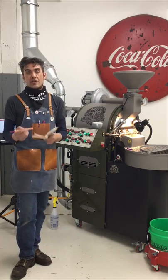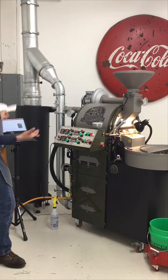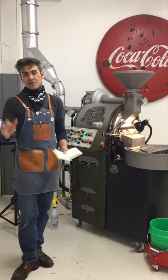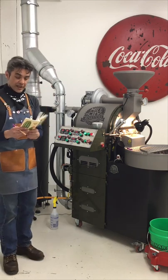The second question I'm going to ask is about ductwork — I'm going to ask about it and look at it. I love this duct work. We set this up, so I know it, and it's the same duct setup as the previous 3K, so I know it's solid. Excellent duct setup. The butterfly valve is installed and it's completely open, which is the way I want to see it at the beginning.